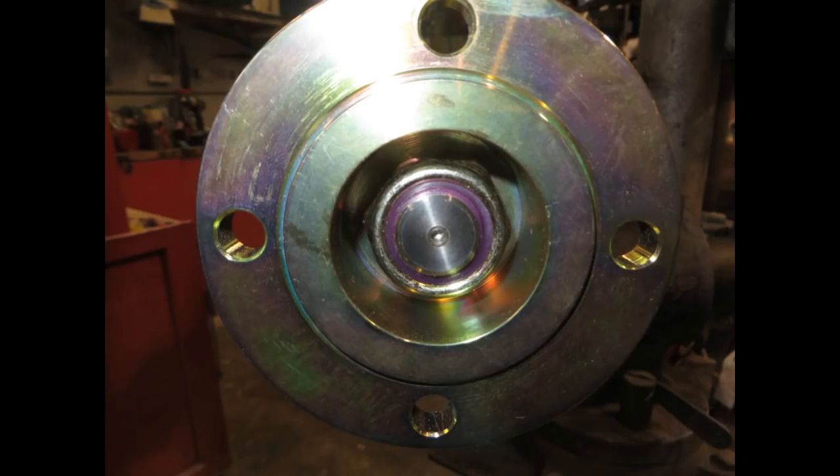This end view is of a modern double taper shaft where the coupling is retained with a nylock nut inside the coupling. Old school couplings on straight shafts will simply have a keyway and set screws. The set screws must be removed, but the procedure is the same to push the shaft out.